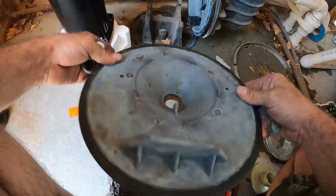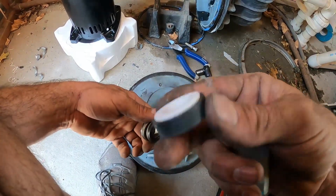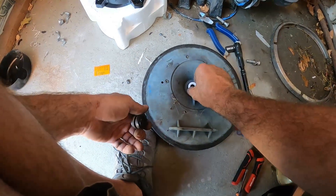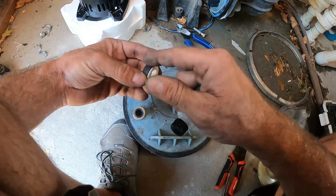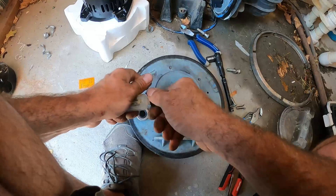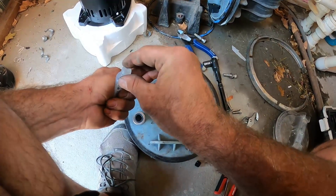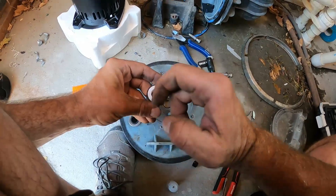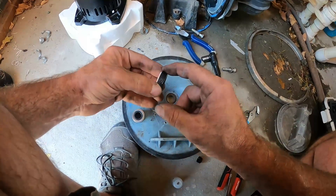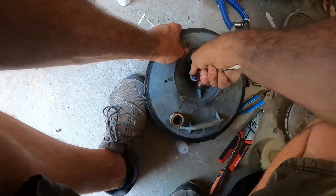With our motor plate, the first part of the pump seal we're going to install is the part with the white ceramic surface — this is just going to push right into the center hole of the pump plate. I like to put some O-ring lube around the actual rubber bushing, or put a light layer of silicone inside the pump plate, just to seal it good. Just make sure you don't get any on the actual white ceramic surface — if you do, use paper towels to get it off immediately. Use the back of a screwdriver to get it to seat solid.